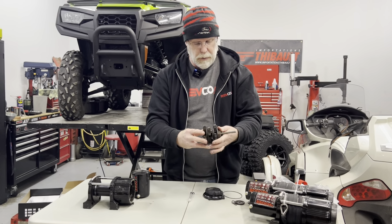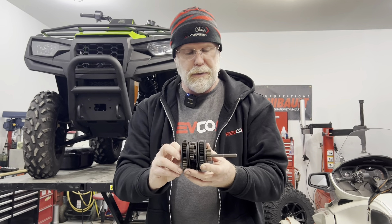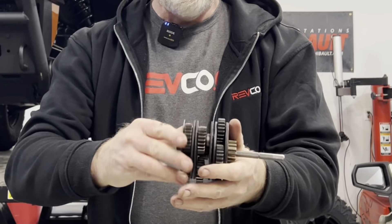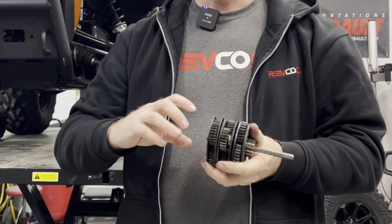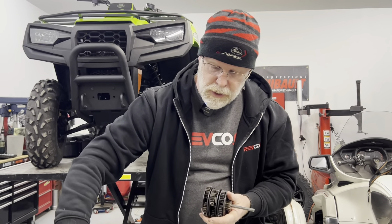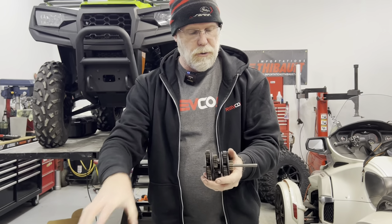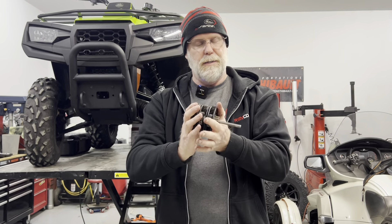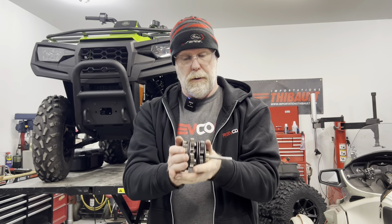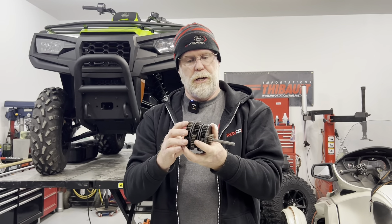This is what we're talking about specifically — the transmission, which is called a planetary gear system. What this does is it gets driven by the motor and turns inside. This is a force multiplier, so this is what is going to drive the winch. You see on the inside of the transmission it's all slotted so these gears run on there. You start by driving one and then another set, and this multiplies the force — this is what makes a winch powerful. It's geared down and it's going to work with the casing here to get you that strength.